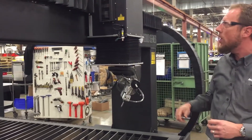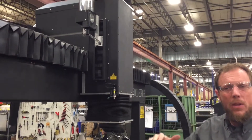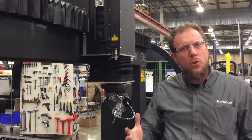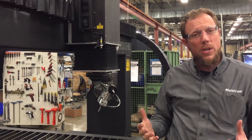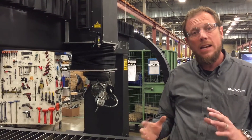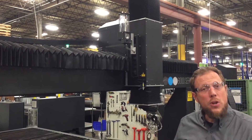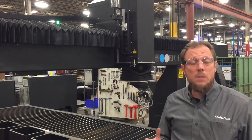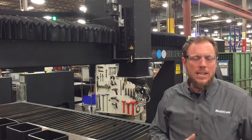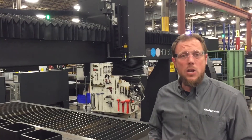This particular customer also got the laser pointer and the extended Ram Z, which gives you really thick cutting capability. He needs to cut thick architectural foam — 10, 12, 14 inches thick on a waterjet. You're able to do it. All that pressure you bought and paid for, you want to use it — because pressure equals speed, speed is money, speed uses less garnet, and speed keeps your cost per foot of cut low. This machine is going to allow you to do that.